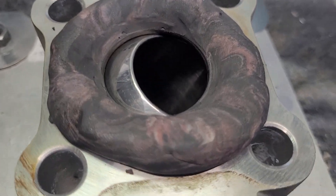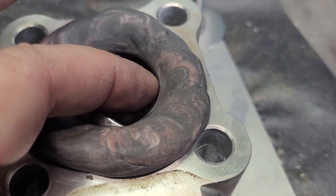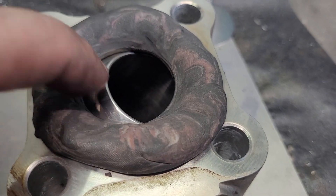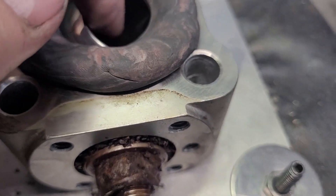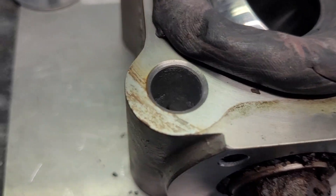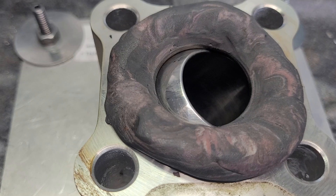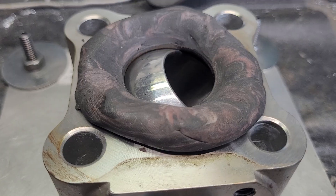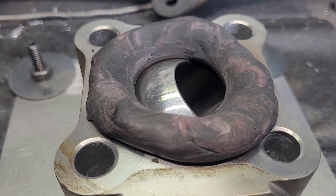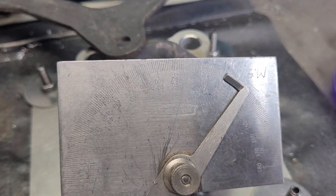That was a little hard to hold, but it was interesting — we had about 300 feet per second there, about 310. It was a little hard to hold exactly on that edge, but that real sharp edge had very high-speed air. Let's increase our angle a little more. We're set at 55 degrees now.